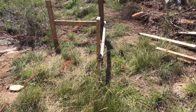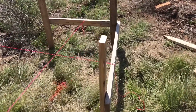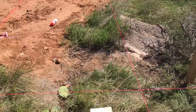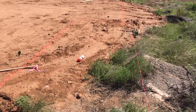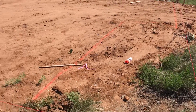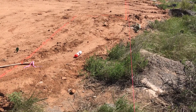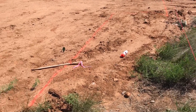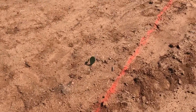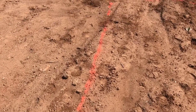Let me explain what batter boards are. This setup right here is called batter boards, and it gives us an envelope for that outside most corner of the foundation. We pull a string line on all four sides that represents the farthest outside wall of the house.